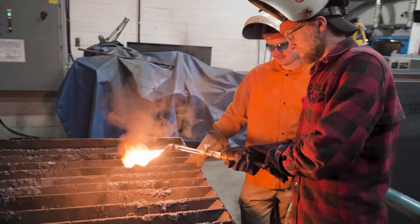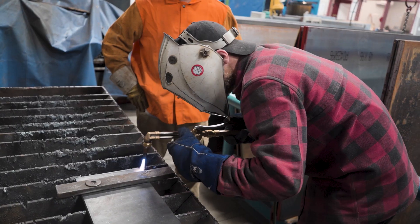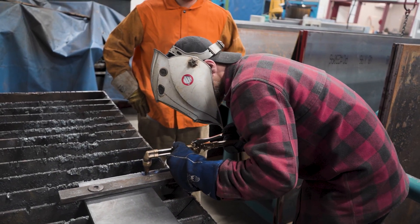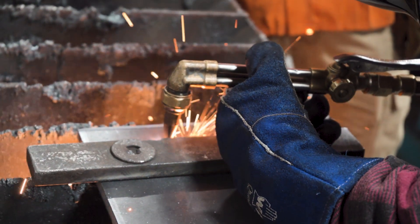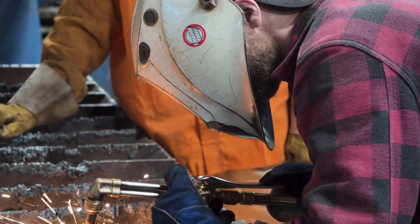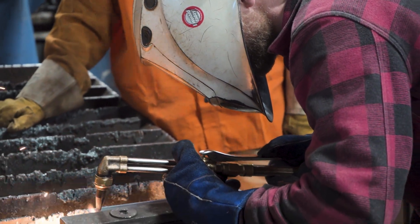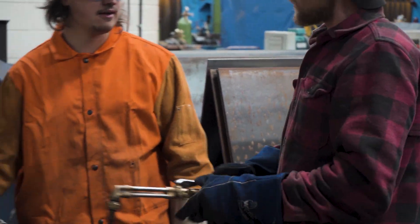What Evan's going to do is some free-handed guided oxyacetylene cutting on half inch material, and he's preparing that for fillet welding. This is where we'll prepare all our material by way of oxyfuel cutting, which the students will then clean up and grind up, and then take those pieces into the booth and weld them. So what we do here is what industry does on a daily basis.